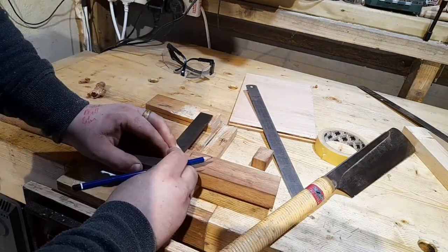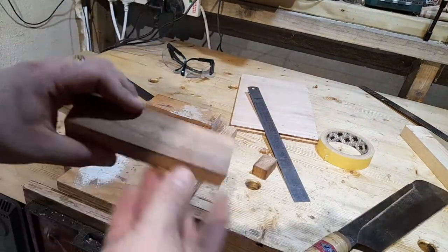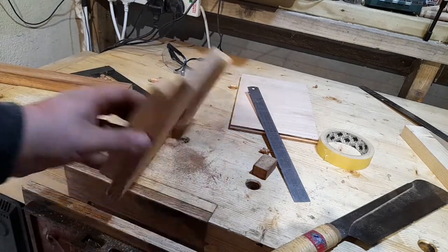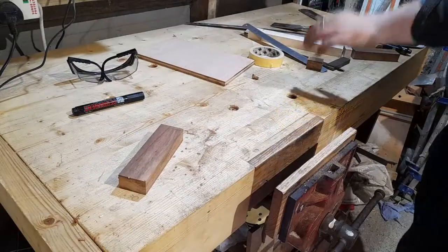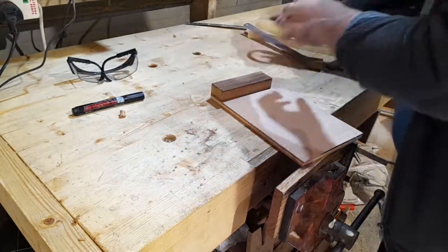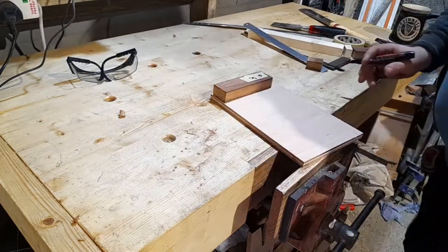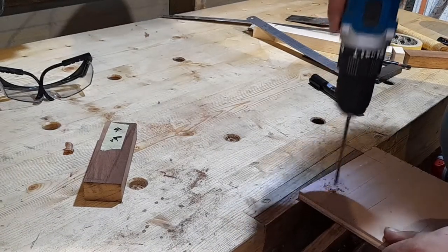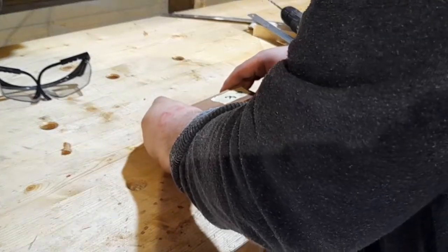On the non-fenced side, it's not vital that it's perfectly square, so I just mark it with a pencil and cut it. But I'm very careful to put a mark on it to let me know which is the side I went to all this effort of squaring up. When I flip this over, you can see the problem — on this end it's really only designed to hook on the bench. So I want to set it up so I have a fence on both sides, and I can simply flip it over and get twice as much use out of my bench hook. Now that everything is nice and square and ready to go, it's time to assemble this, being very careful to have that square edge pointing to where I need it to be. I'm just going to glue these in place, mark up so I can see it, glue it in, and temporarily affix it with screws. When the glue has set, I'll draw those screws out and replace them with dowels.